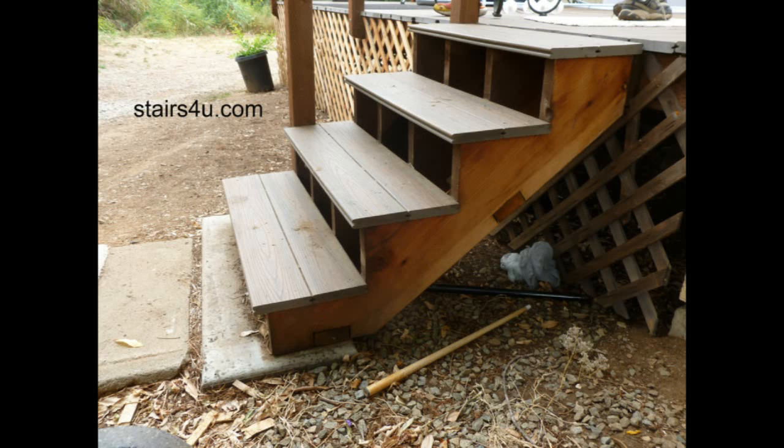Here's something structural engineers probably don't want to see — actually notching the bottom of a stair stringer so that you can install some type of a nailer. Realistically, there is no reason to have a nailer notched into the stair stringer. You could simply nail it over the stair stringer instead. If you notch it in the wrong spot, you will actually weaken the stair stringer considerably.